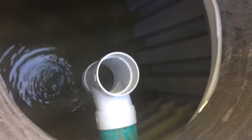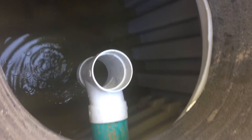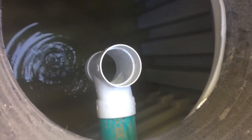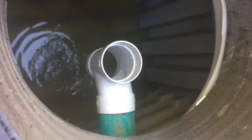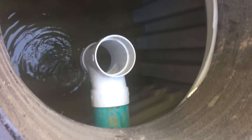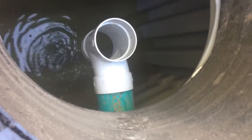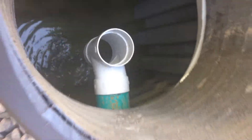You can see how severe that leak is. That could easily be a thousand-gallon turnover in this thousand-gallon tank in about three or four days. That's water that you didn't use, and that's really bad. This is probably a leaky toilet because none of the faucets or anything — they can't see anything leaking. So this is where the toilets have to be dye tested.